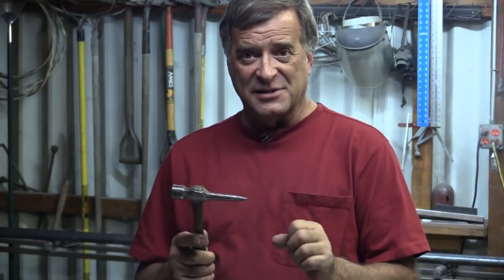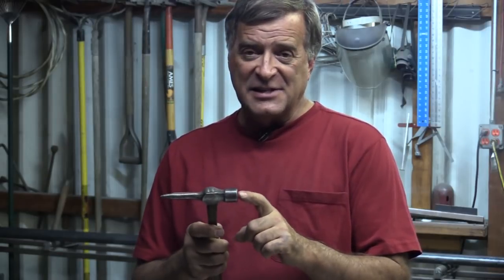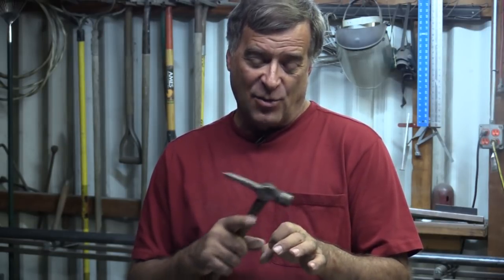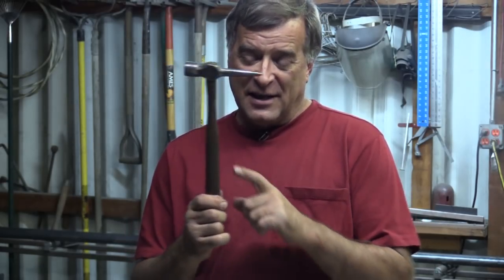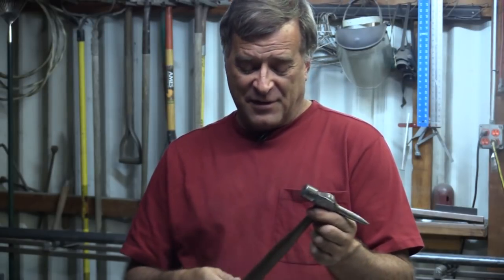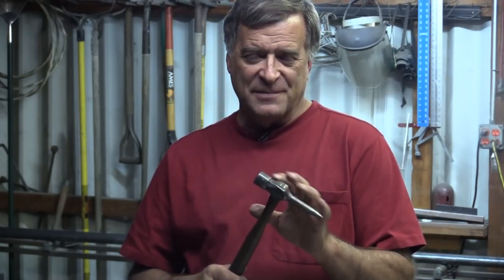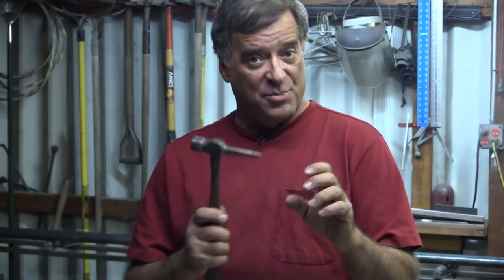It was for shaping, for working in tiny areas. I use it for getting down in the little holes, working in little tiny spots where even this head is too big. If you want to get a little dent out, don't choke it up here — you don't have any power. Hold it way back here and you can get a lot of force with it. It doesn't weigh much, it's not going to tire your wrist or your arm. You can work in a tiny little area, working on a dent, trying to get a dent out — or trying to put a dent in.